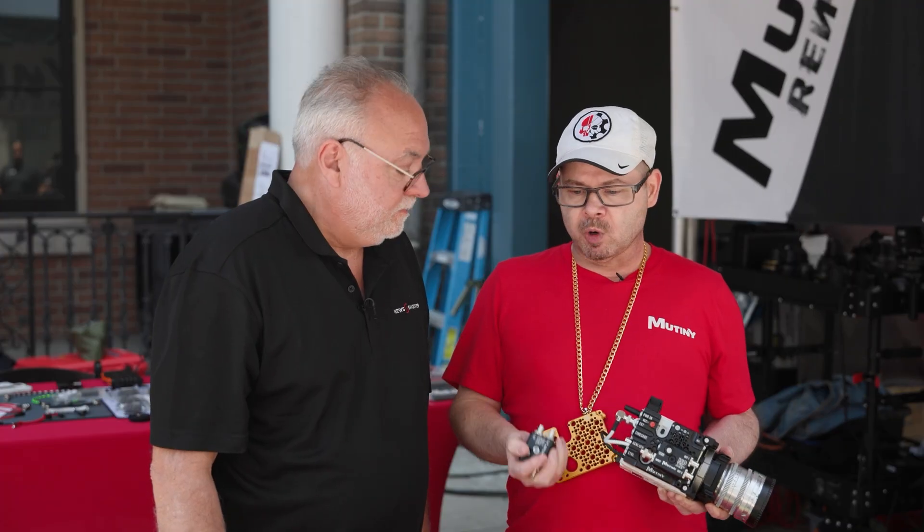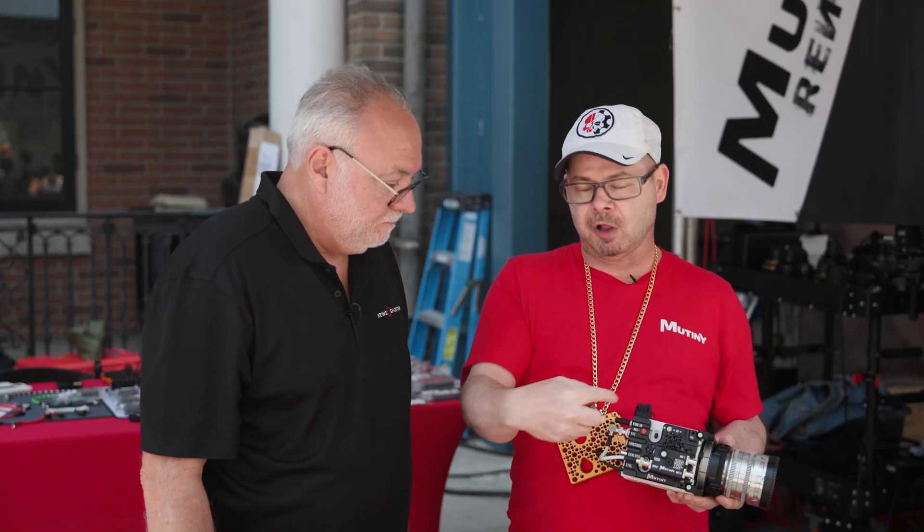12G and honestly all SDI in general is not impervious to power issues. There are things you can do to help protect it, like using safe tap power cables and following the SDI process. But with a lot of the most inexpensive monitors these days, they have a barrel connector for power. If you remove that power, the only place it sometimes has to go is down the SDI, and it goes on the signal instead of on the ground. What ends up happening is you fry the port on the camera — a very bad thing. If you have to send it in, you're going to spend 500 to a couple thousand dollars to fix that.